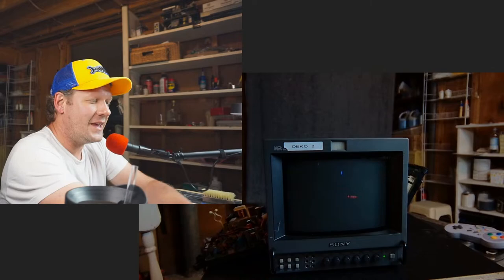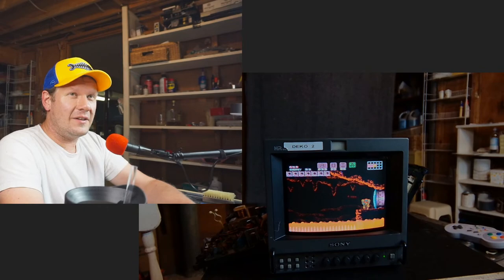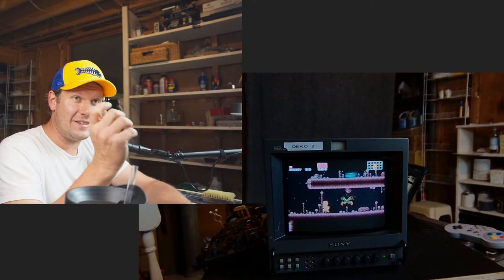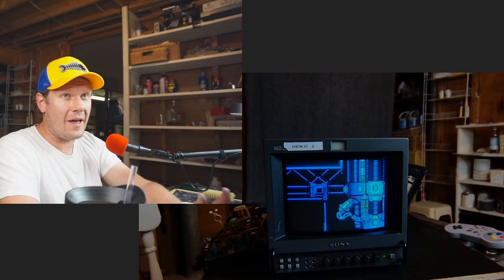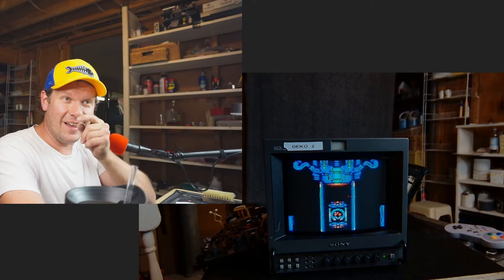He was like, hey, Steve, I got the kit and now my screen is in half. And I said, oh, well, send me a picture of your work. And he did the same thing. He had one capacitor in backwards, but this darn capacitor lasted like 8 or 9 months backwards. Finally it was swollen and about to explode, but it had literally been reverse seated in the chassis. And somehow the CRT functioned normally for a long time before it gave out and caused problems. Absolutely. Don't install your caps upside down and expect a good result.